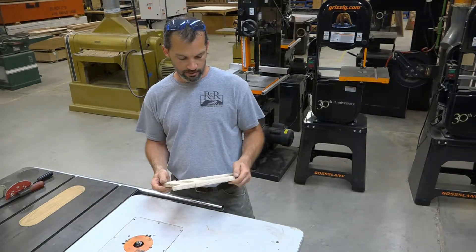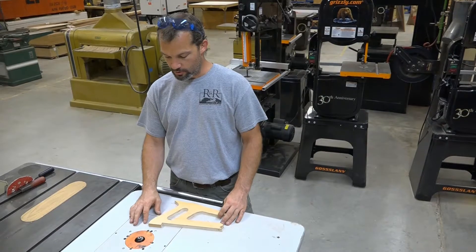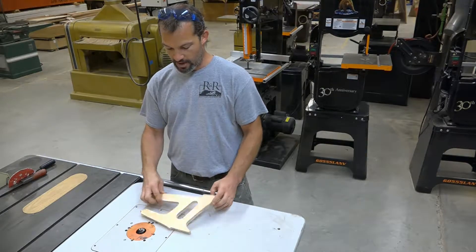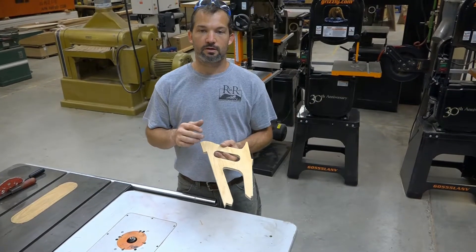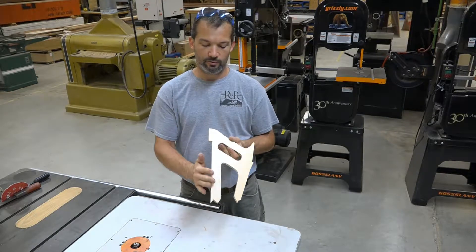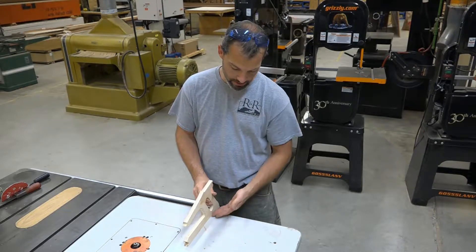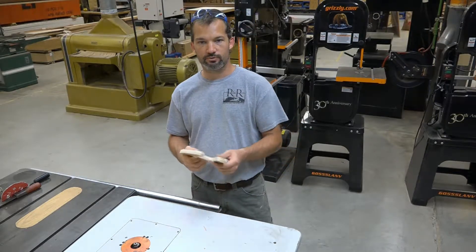The last thing I'm going to do now is go to the router before I do my final sanding. When you use the router, remember to go the opposite direction that the router bit is spinning. I'm going to router everything except for the whole bottom edge. Students often get so focused on routering that they router all the way around and router that part too. If you router the bottom edge, when you're cutting on the table saw, it's hard to tell if you're sitting flat on it. It's really nice to have the edges right down to a point so you can see you're sitting flat when you push something through on the table saw.